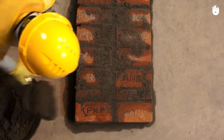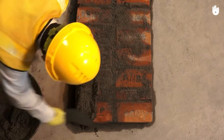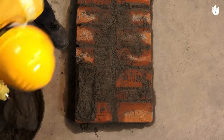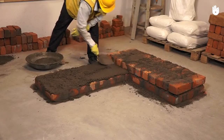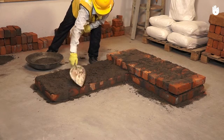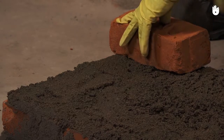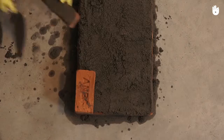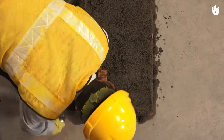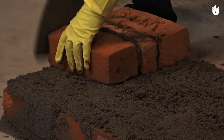Lay a mortar bed for the second course of the first wall. Now, set up the outer profile guiding the second course of the first wall using two queen closers on either side of a centered stretcher, together filling the interior between two bordering stretchers.